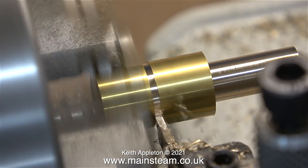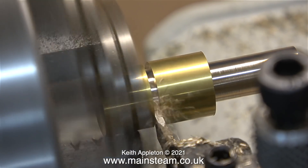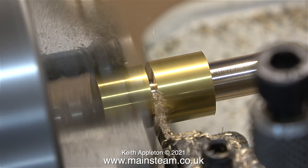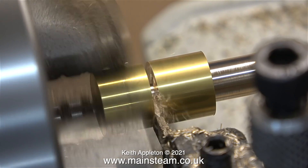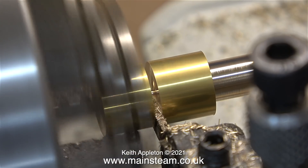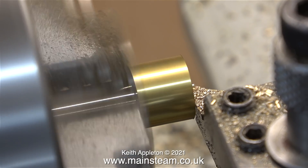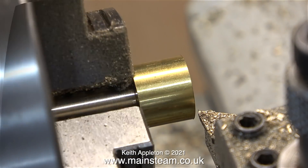Here I'm parting off the part-finished fitting. It's a bit of a strange one — the original water bypass valve was held into the tank with a nut inside the tank, which is inaccessible. Luckily I did manage to unscrew it by twisting it from side to side to lock the nut against the inside of the tank so it came off. This part of the fitting will be Loctited into the hole in the tank, or better still I may use some JB Weld, but not until it's finished. That's the parting off procedure complete.